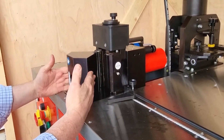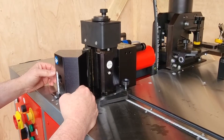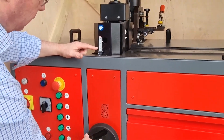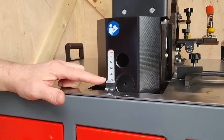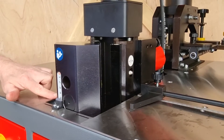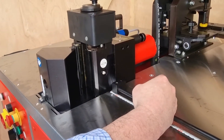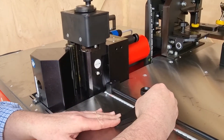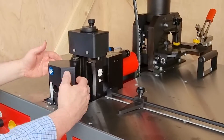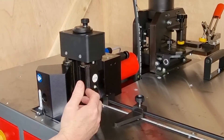An important thing to remember is that we need to bend an equal distance from the centre of the piston. So if the bus bar we're bending is 100mm wide, you raise or lower the head — so for 100mm we're going to lower it to 50mm. That ensures there's an equal amount of distance from the centre of the piston from top to bottom. If you're bending a 90 degree from say 200mm in from the edge, you can set it for 200mm, bring your bar up, and you'll get consistent bending. As the bend is being performed, when it reaches the desired angle, it will automatically cut the hydraulic pump on the machine.